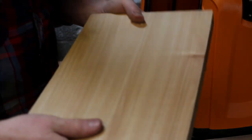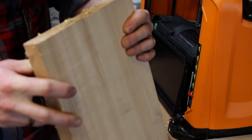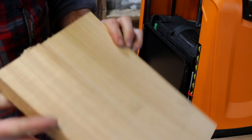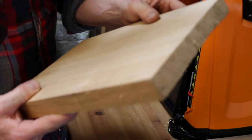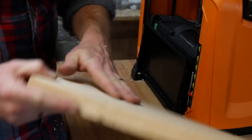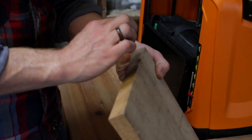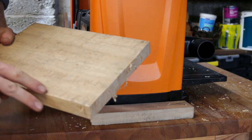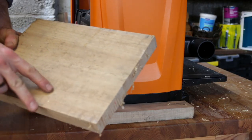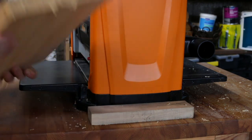It's now giving us a plain surface all the way across. Of course this isn't going to be perfect because it was a cupped board to start with, but now we should be able to put this side face down and then flatten the other side and get an even thickness all the way through. I'm now expecting it to take out material from the edges first, and then once we've planed the middle it should be even thickness.